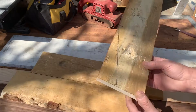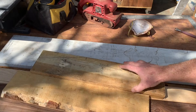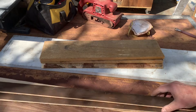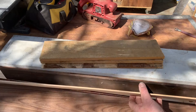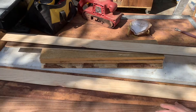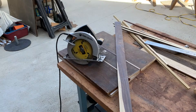For the neck, you cut out the neck profile on three pieces and then laminate them together. I'll put a little walnut veneer in between as stringers — that gives it a cool design and a little more strength. I've got another part of mom's shelf for the sides. This one may be a little thin so I've got to plane them down to the right thickness. And I'm going to get my piece of rosewood that I got at the hardwood store — it's been a couple years so it's good and dry now. I'll cut it an eighth inch thick for my fingerboard.